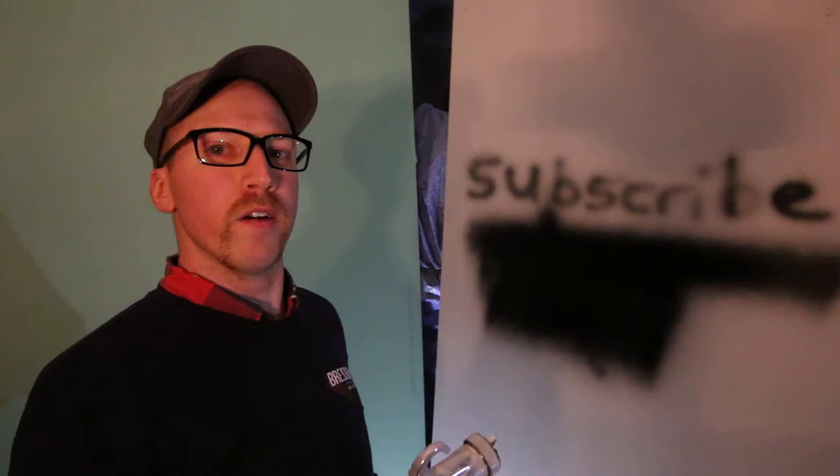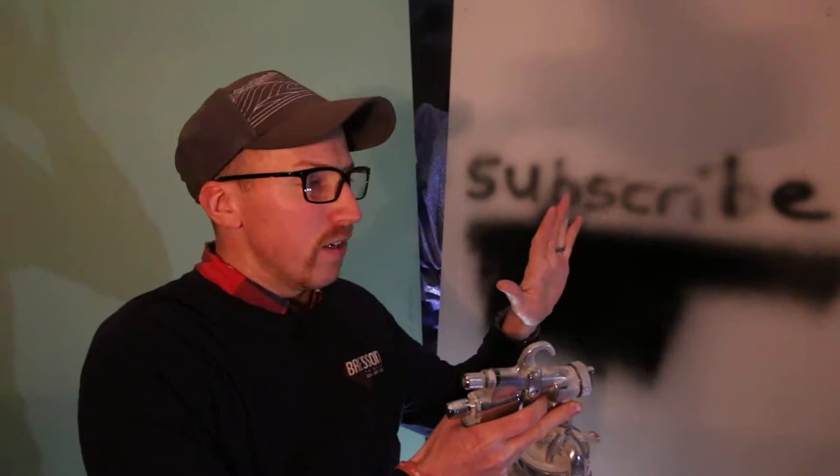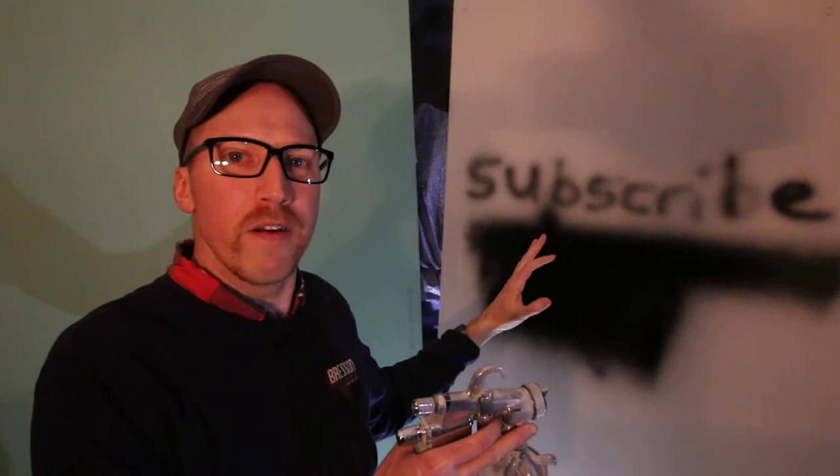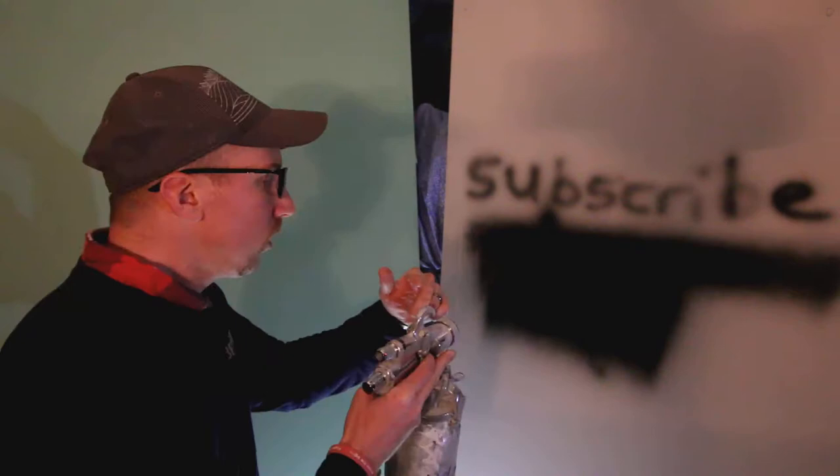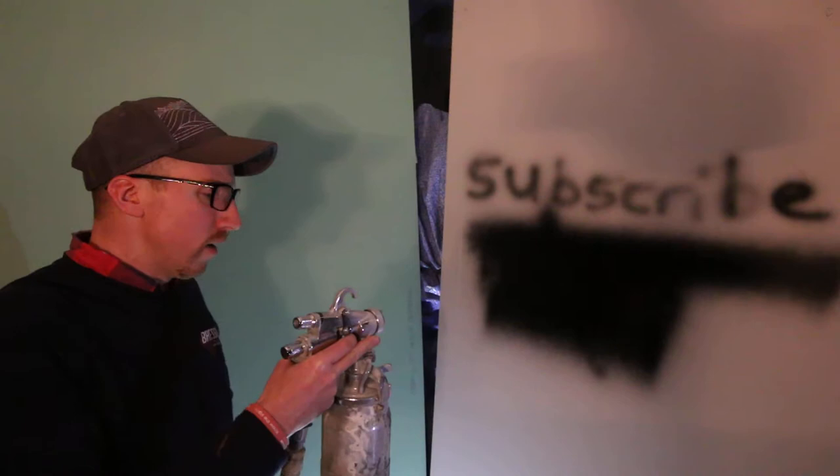You might switch over then to your cabinet doors and start spraying, and if they're in an upright position, you might get some sags. So even after you think you get everything dialed in, when you switch over and spray your material onto your project, still do a little test spot just to make sure everything's dialed in the way you want it. All right, I'm going to play around here a little bit more. I'll show you guys some other spray patterns, and we'll see how fine I can get this dialed in too.